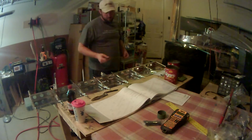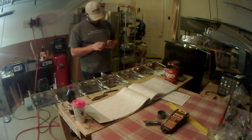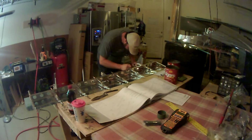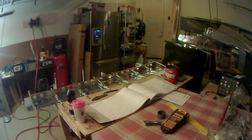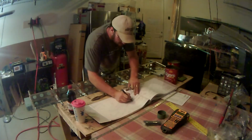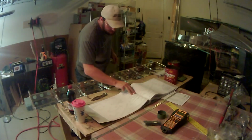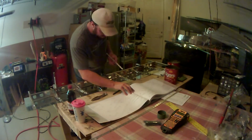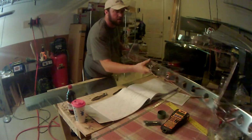So that kind of hopefully will help clear it up. In the next video, I'll show actually match drilling those pieces, but that's how you ensure that the hardware will line up so that when you go to actually attach it, it's not misaligned and it's not at an angle, and the flap will actually move correctly and not bind.